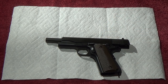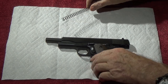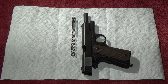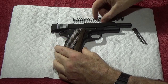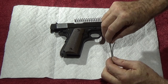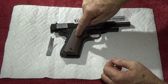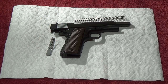Here are the nice springs we're going to use. This spring here is for the recoil, and this spring is for the trigger — that's going to give us a lighter weight on stage one and stage two, making the trigger a whole lot nicer. That's about an eight-pound trigger; we want to take it down to about three and a half, which will be good for carry weight if I decide to make this an EDC.